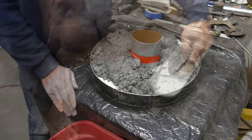The furnace is pretty much done, except I want to put the ceramic coating on it. This is something called Fran-Kote — jury's still out on this stuff. I went ahead and lined it: you do five parts powder to six parts water by weight, mix it up, and the guys at the place I bought it from said that's what you start with, then add more water to adjust consistency. I'm just going to paint it on the lid and the entire furnace as well. I put two coats on both the furnace and the lid. I can tell you it's holding up pretty well — it's still on the furnace walls and hasn't come off.